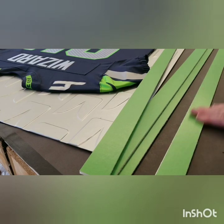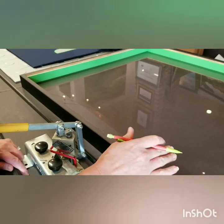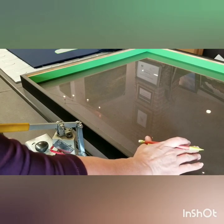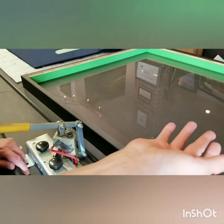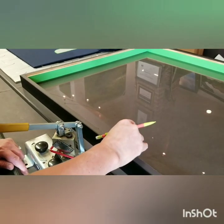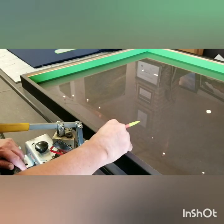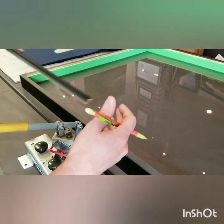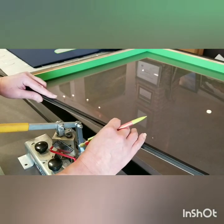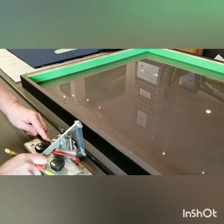We're coming to the finishing touches. I've installed the Optium Museum acrylic — the Tru Vue OMA is perfect for this because it's anti-static, UV blocking, and lightweight, so it's perfect for traveling to the show. I've added the bright green walls, ATG'd and glued them inside the edges of the frame. Next I want to line with a fillet inside that so it'll really help define the piece, so I'm just measuring, marking, cutting, and installing.